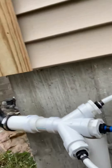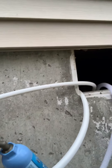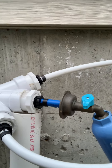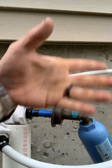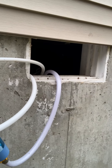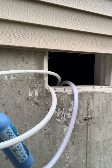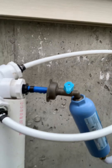I have a hose connected to an RV filter — a 5 micron RV filter — which works out for cleaning most of the garbage you want out, and charcoal. I've got a couple of PEX tubing hooked on here with nozzles on the end with valves that I can bring around to my water collection system in my basement and fill all my different IBC totes up. If I run one dry, I can fill that one up, then move the hoses over and fill up the other one.